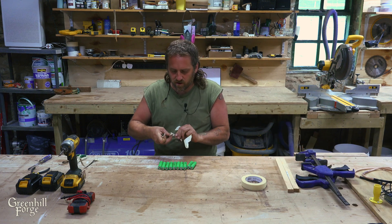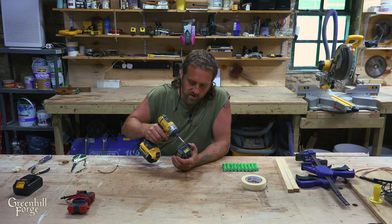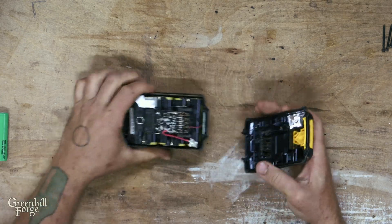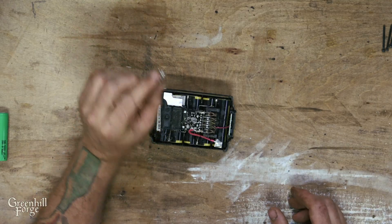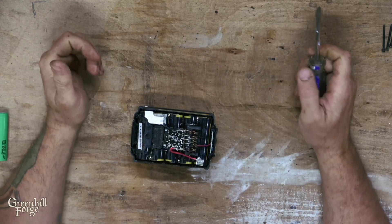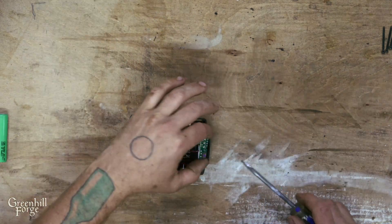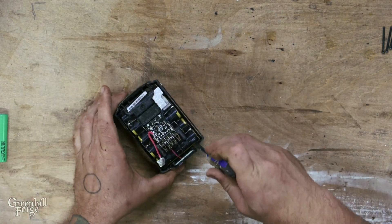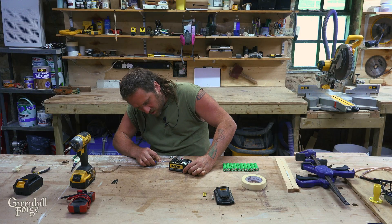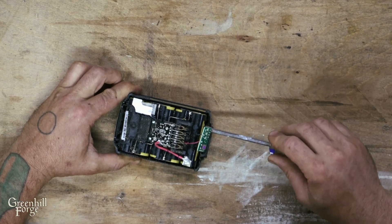I'll save this nickel strip because I can use it in the batteries. The first one I'll put together is just rebuilding this original battery. I'm going to take it apart — these four screws should just come apart really easily and then the top will just lift off. Now I need to basically just remove this inside bit, and I'm going to be really careful because I don't want to damage any of the cells as it comes out. The little battery monitor in the front should just pop out, and then really carefully I'm going to start prying it out with a screwdriver. This is one place where you could actually do quite a bit of damage — breaking into a cell, shorting it, getting electrocuted — so this part is just super slow and careful.